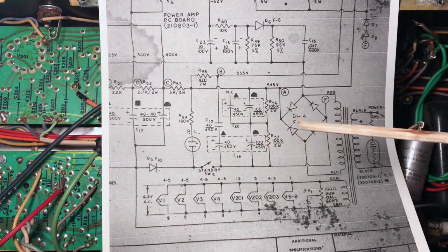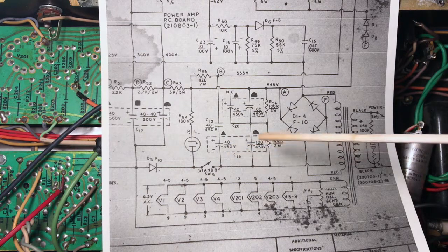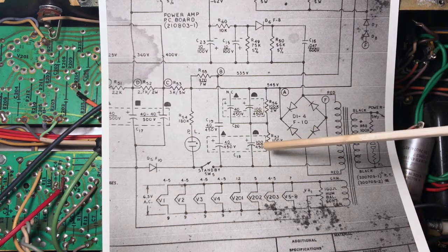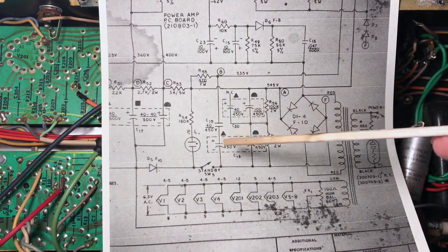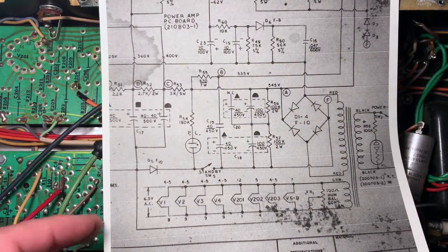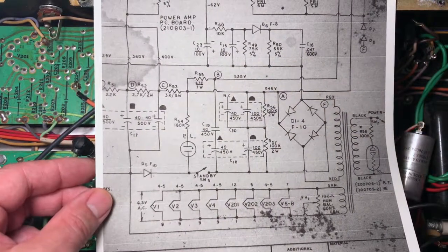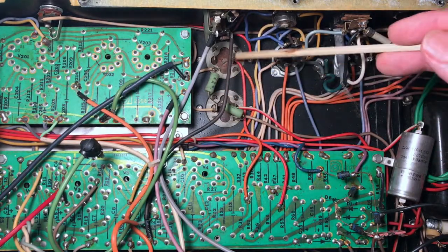So what they did, and there may be other ways of doing this, is they used one of the capacitor cans connected to the ground structure. So this would always be 0 volts. It wouldn't be a different voltage. So that could be used in series with a discrete capacitor to supply the voltage for the B node. Otherwise, you'd be mixing voltages between the B and A node, and I'm not going to think through what could happen there. Could there be other ways of doing this? I don't know.